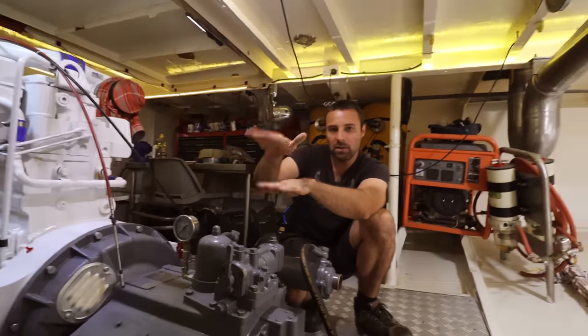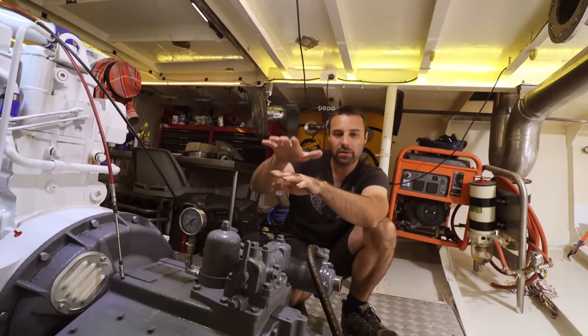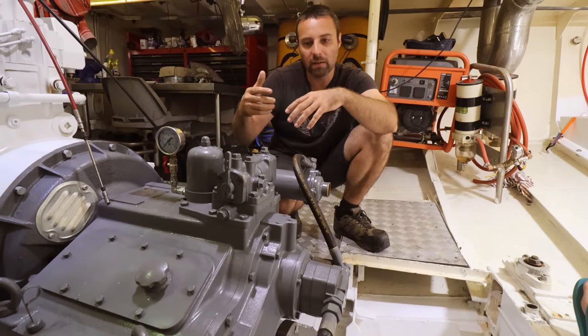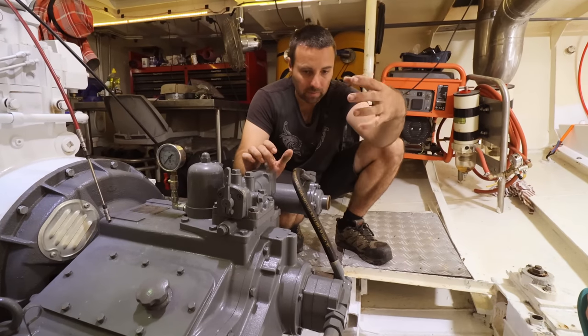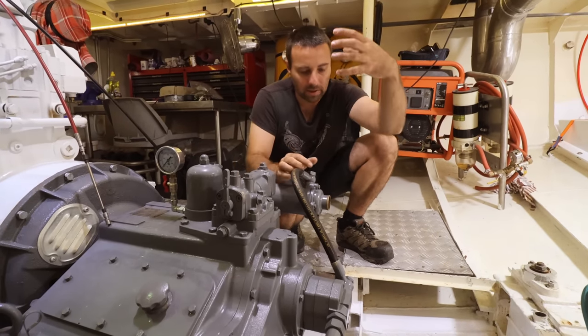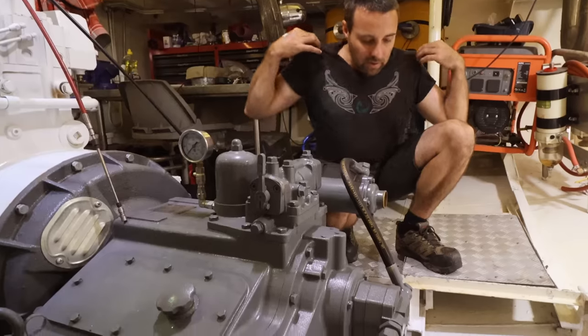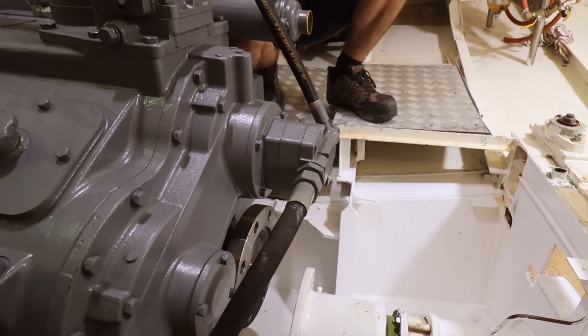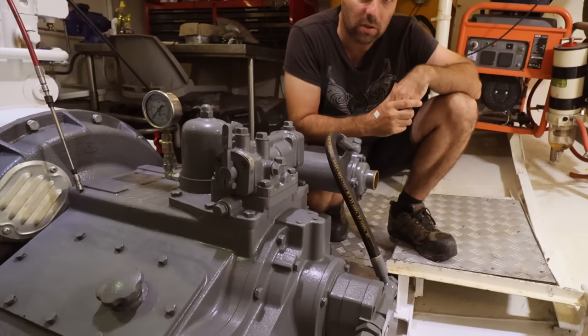That get home motor actually sits up here above the gearbox. And then there's a hinge mechanism which disconnects the electric motor from the drivetrain when we don't need it, so we're not spinning that motor needlessly. But it has a set of belts that basically run from the output on the electric motor down to the propeller shaft. The coupling that Daniel's making has a big belt drive mechanism on it so that we can connect that get home motor to the shaft.